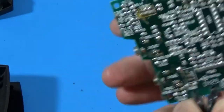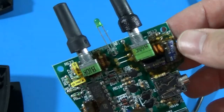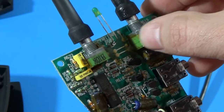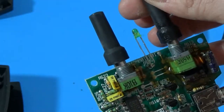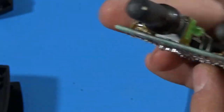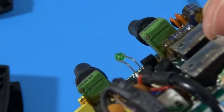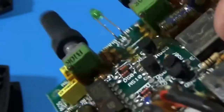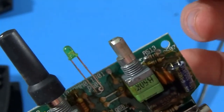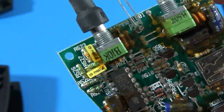We've got the jacks here on the side. This one's for the subwoofer, this one's for the main. What they did is they have two independent channels and they just ganged two potentiometers together for each channel. So when you're turning it, you're just turning the two. They look pretty sealed — hopefully there's a way to get in there and actually clean them. There's like a rivet in the back. I might be able to just spray in there and turn a few times. Alright, we've got a few caps gunked down — we can take a look at those and see if they're any good.